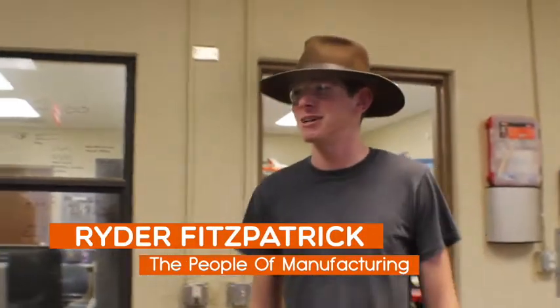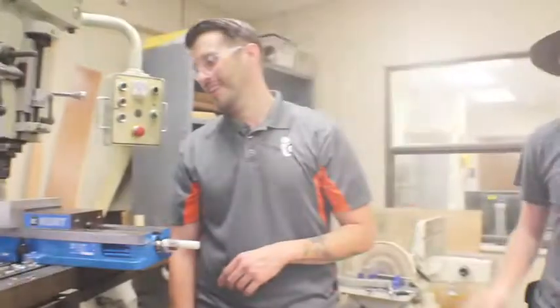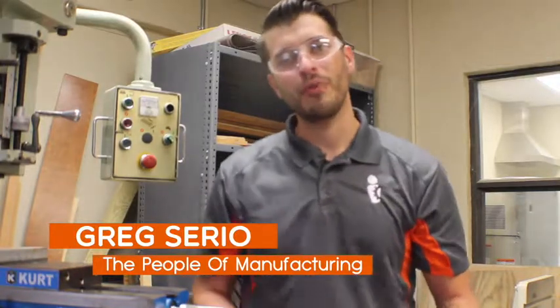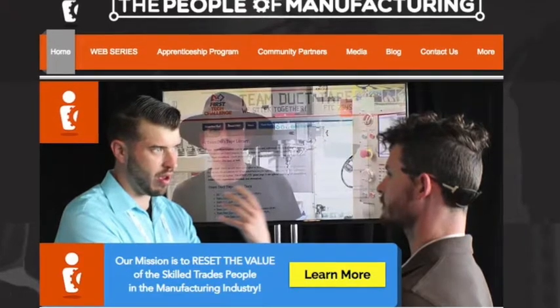My man, how are you doing? Pretty good. I'm running the milling machine here. Your cut's a little on the rough side, but throw some carbide in there, a little bit of coolant, bump the speeds and feeds up maybe a little — might have some pretty nice results. But speeds and feeds, that's a whole other video. If you want to learn more about manual milling machines, go to peopleofmanufacturing.com and learn how you can join an apprenticeship program near you. See you there.